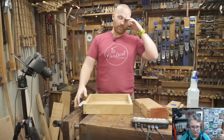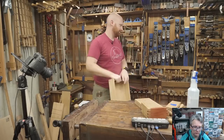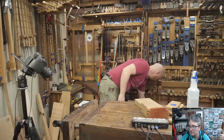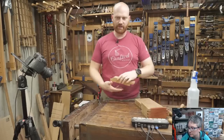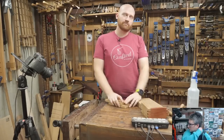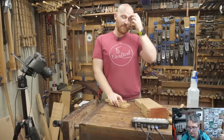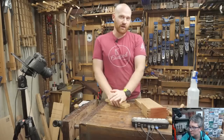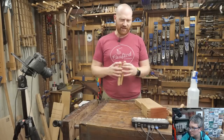But if you get into doing dovetails and you've done a few of them, it's not that difficult. It's one of those things where you just have to understand where the problems are going to be and be ready to spend the time there. They will take longer than a regular dovetail, but they are a lot of fun. And they're a good show tail — because the boards have to come apart at 45 degrees, they hold themselves together, so you don't have one board that can slide straight off the other. This joint took me about 45 minutes for the practice joint I did today.